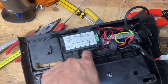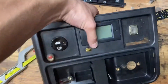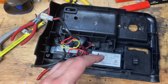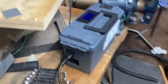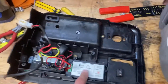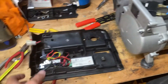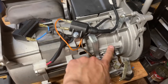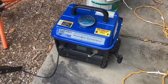The only other thing is this little display might pop out - it's pretty snug - but I might add a few drops of glue onto the periphery just to help secure it against vibrations. I always hesitate to glue things together permanently, with the theory that I might take something apart in the future - a perfect example being this test set where I upgraded the meter. A few dots of E6000 around the edge should hold it in place. I'd love to show you a test right now but it's getting late - the generator is in pieces and I'm waiting on some gasket maker to cure before I can fire it up, so that'll have to wait until tomorrow.